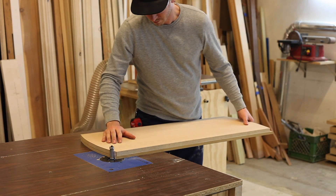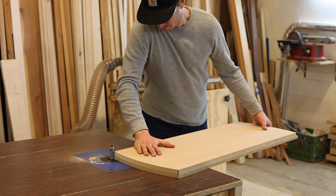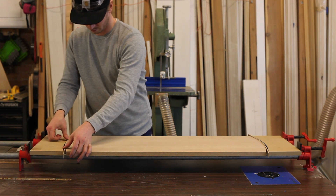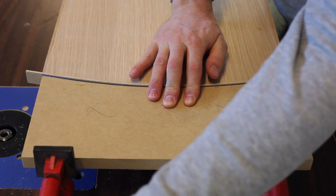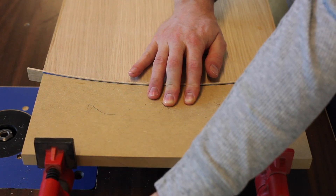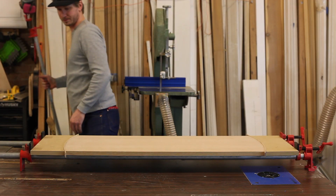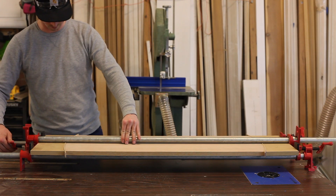Now the next step is to flush it up with the template. I use double-stick tape a lot for applications like this — if you've never used it, I highly recommend it. Now you can kind of see what I was working at: getting the negative template and the positive template together just so I can clamp the edge banding to the top and bottom of the sides properly, to get even clamping pressure along both. You can also see I'm using some blue tape to shim off the cauls a bit, just to fill any discrepancies from the template routing to really apply even pressure. With everything clamped up, we're all done with the edge banding. I'll flush it up off camera and then get started on the rabbets.